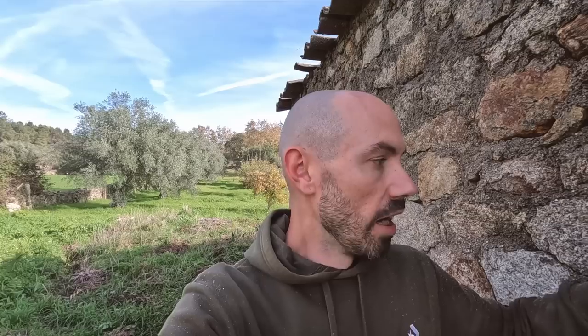This is by no means a perfect job — I'll have to do this again once we've taken all the concrete mortar out of the walls. A couple of tips for anyone interested: first, I specifically purchased a low-pressure pressure washer — it only goes up to 1000 PSI. That was a recommendation from many people: when pressure washing granite, don't go too high because it will damage the stone. Even with that small pressure, I definitely experienced that — in certain corners or where stone is already slightly damaged it blasts it off instantly.